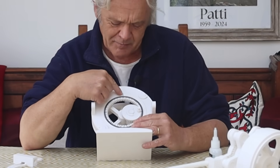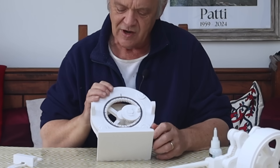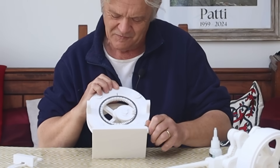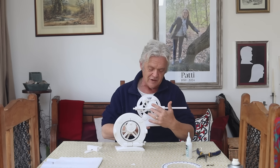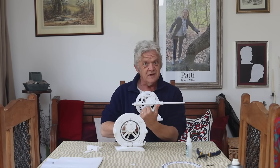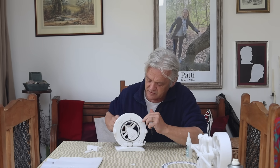There's a black mark going straight down to the ring, and on the ring there's a gray dot. The first thing we have to do is line up that gray dot with that mark, which we do by turning the little handle on the worm gear. That moves the inner ring until we get it lined up. Once it's lined up, we put the gear on — the drive pin also has to be in line with that mark — so the dot, the mark, and the drive pin are all in line.